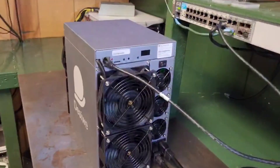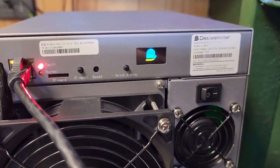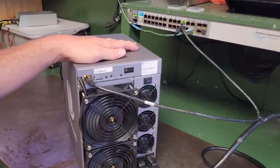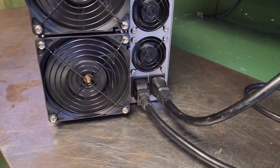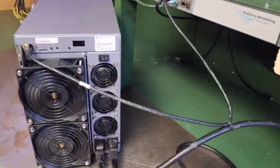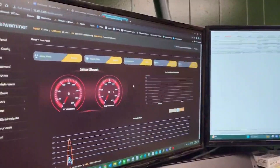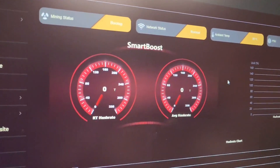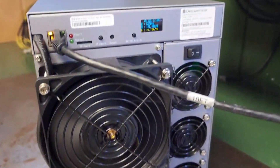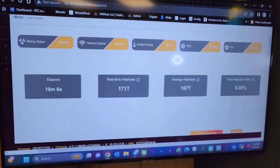Alright, we got it back together — let's turn her on. Set baud rate, got the little logo popping up at the beginning, doing a hard reboot on it right now. Note that the power supply is not two C13s but two C19s — so it's like a twice-the-watts miner, and the PSU is around 5,400 watts. This thing's got speedometers on it! Alright, we got our hashing — 171 terahash right now.